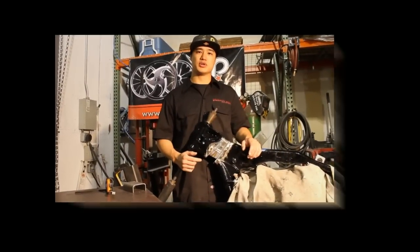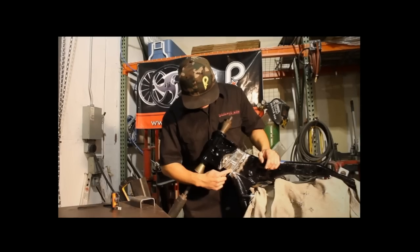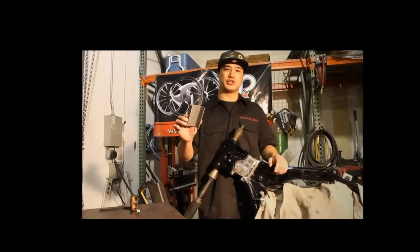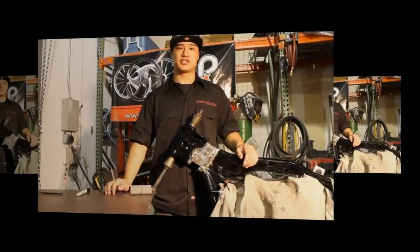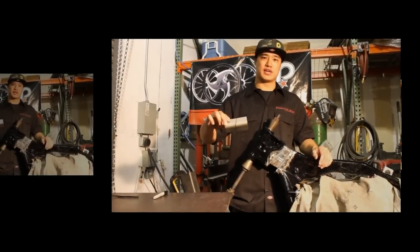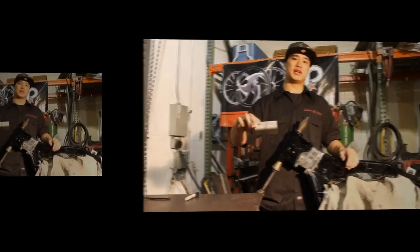To fill the lower portion of the frame, we're going to take two measurements: one from the top and a second from the bottom, and we'll apply that to the larger U-channel. For this project, we measured inch and three quarters on the top and two inches on the bottom. We've transferred that to our U-channel and now we're ready to cut.